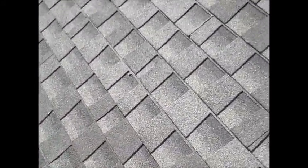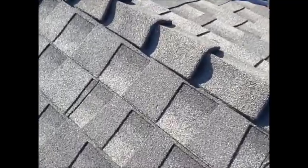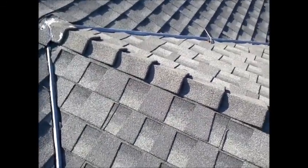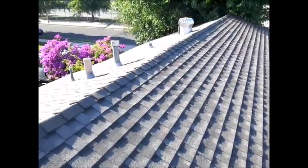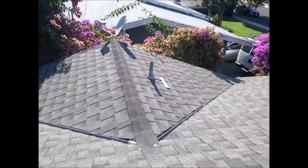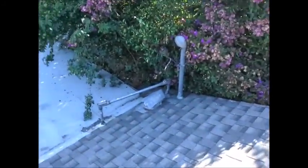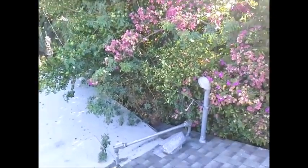It's a composition shingle roof, probably about six years old. The ridge cap is in fairly good shape with very little minor deterioration — they typically deteriorate at six to nine years, so you're doing well. There are some tree limbs on the roof in the front of the house and a bougainvillea bush growing on the surface. Over the kitchen area there's more bougainvillea. Your electrical service cable goes up through a lemon tree — the power company will cut that back at their expense since it's their wire, but they need to be notified.